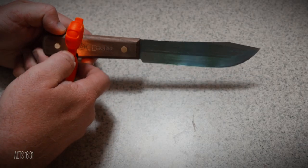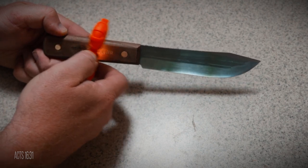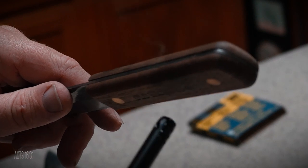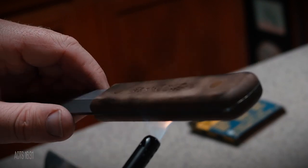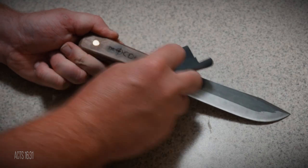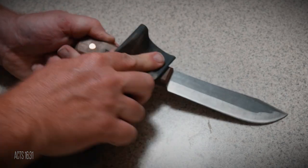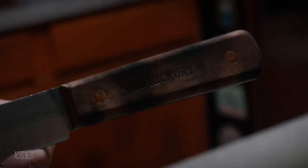After I tried to put the logo in the handle, I did some wood burning on the handle to give it a little more character. I experimented with both a torch and a regular flame lighter to see the contrast and which did a better job. I actually think I liked the regular lighter better — it took longer, but it gave me a better look. When it was all said and done, I put a good healthy coat of olive oil on it everywhere — wood and all — worked it in, and wiped off the excess.